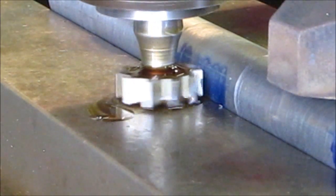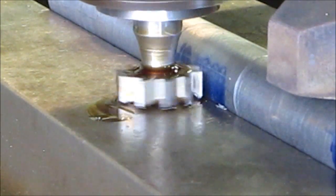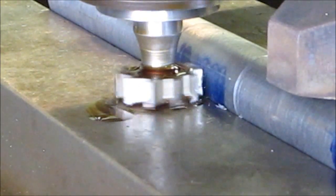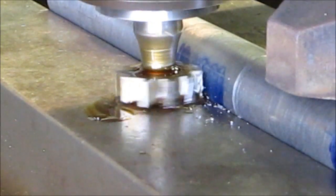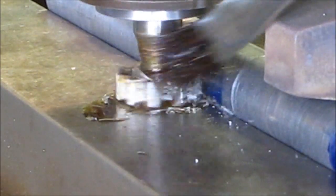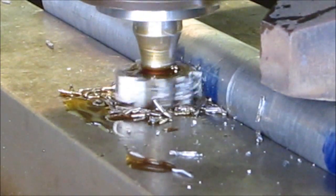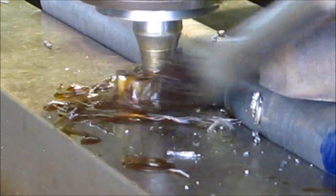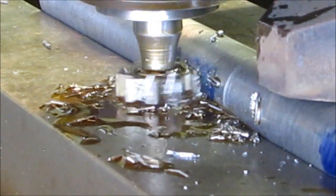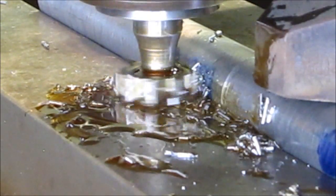We just touched off and we're going to set 445. We'll go through and be at 445, and the 145 will be 300. This is like aligning your part without really dialing it in — you know, the table groove and everything else for what we're putting in here.